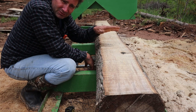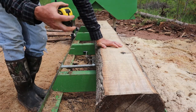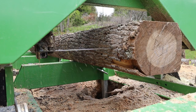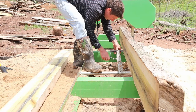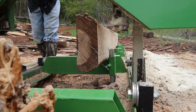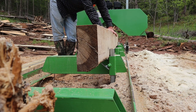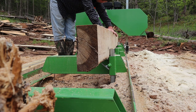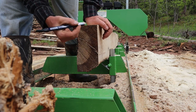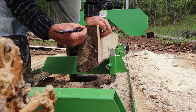All right, so after I make this 4-inch cut here, I'm gonna turn it upright. Watch what I do after that. I've never done this, but I think it's a good plan. Let's see how it works. So now I'm gonna prop up one side. How am I gonna do this? Basically I want a wedge now. I want this to come down 7/16 and this to come down a full inch, so you have this type of shape.